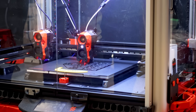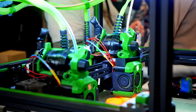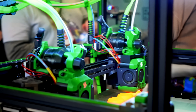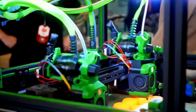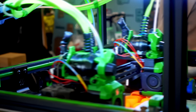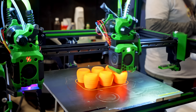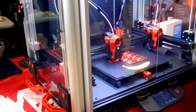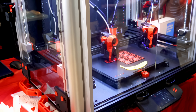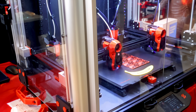But printers like these you just can't buy off the shelf. A big topic for Voron right now is exploring IDEX again — independent dual extruders. It's two toolheads that ride on the same gantry and share their y-axis movement, but can extrude and move in the x-direction independently of each other. Either they have two different filaments loaded and the printer switches between them for different parts of the print, or they run in sync mode to print the same part twice or mirrored.